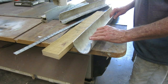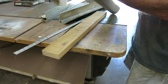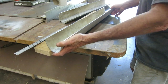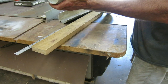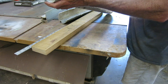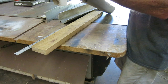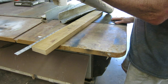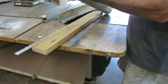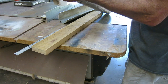I'm going to use this for a trough. I'll have to plug that hole. It's not going to be a very steep angle because it's such a long way from where the windlass drops the chain to the opening into the chain locker. I think as long as there's chain going in, the weight of the chain will pull it down the slope. But if you pull out past the chain to the rope, the weight of the rope won't pull the chain down, and it'll pile up in a rat's nest — which is already happening. That's why I wanted an open top, so you can just reach in and straighten it out.